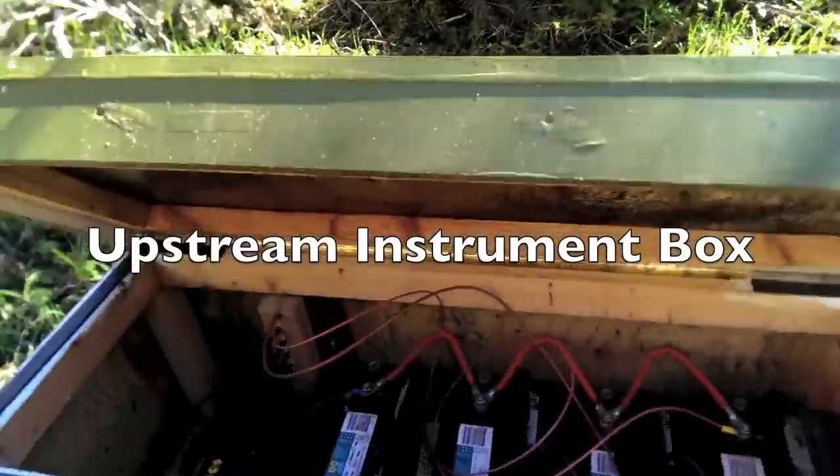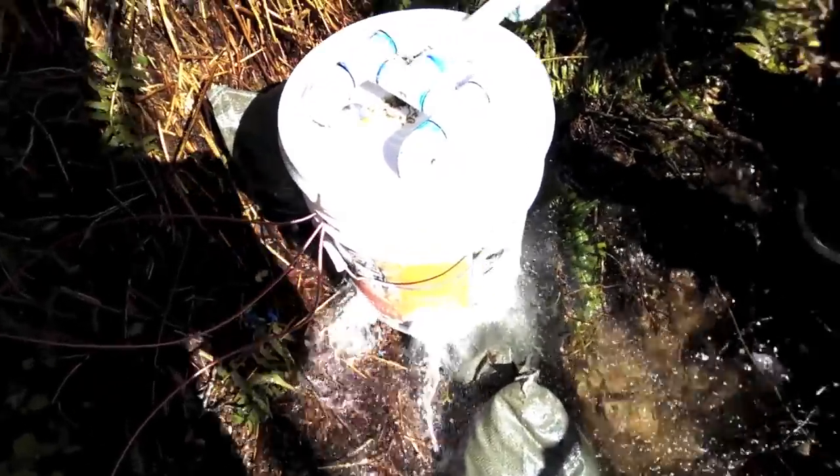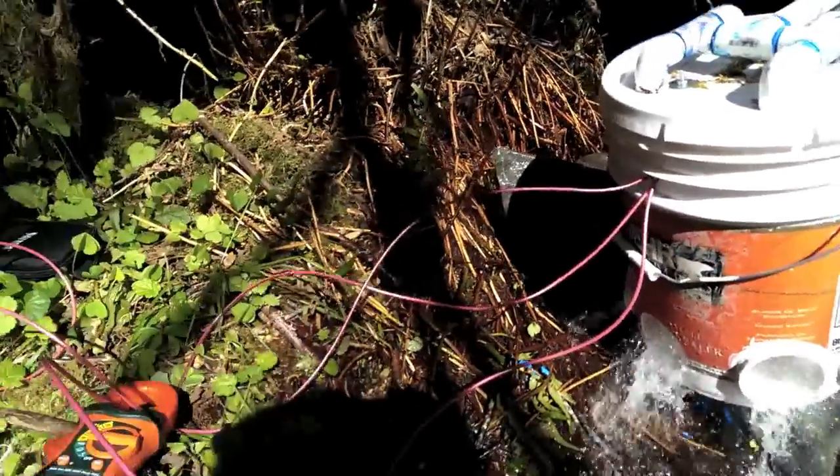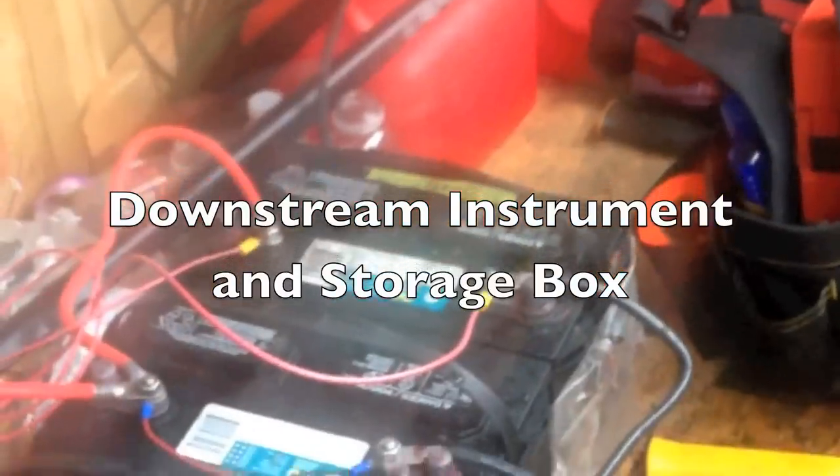The multiplexer in this box controls four of the eight antennas in the array. These are the batteries, and the Pelican case has the instruments in it. We've got a switch that feeds current to the batteries when they're charging, and dumps current to ground when the batteries are full. The generator is purring along, putting out between 0.72 and 0.8 amps. The primary box has a generator, tools, four more batteries, and another four-way multiplexer controlling the other four antennas. When we hooked both arrays to the generator, they generated noise that interfered with each other, so we have to add a second generator so they can run off independent circuits to avoid noise interference.